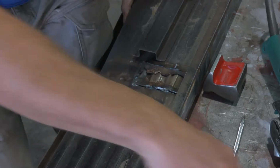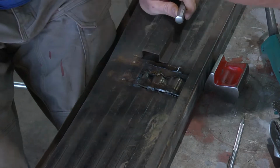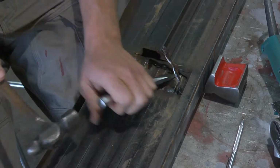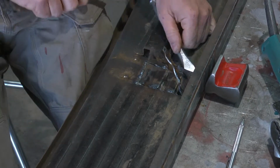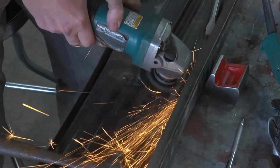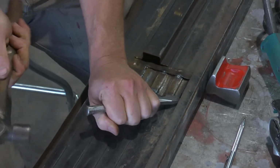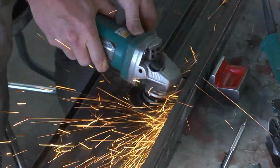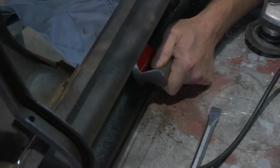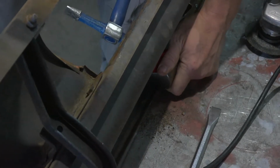Once you've got it welded in place, the next step is to remove the piece that you welded over and knocked out of the way. You see that rotten piece I'm busy beating out right there. It doesn't take long to do. It's actually a very effective way to get a really good fit using any sort of wire feed welder, because the wire feed welder is not only more tolerant of a gap, but really kind of needs a gap, almost exactly a disc width. And of course then beating everything into the final shape before finish welding.